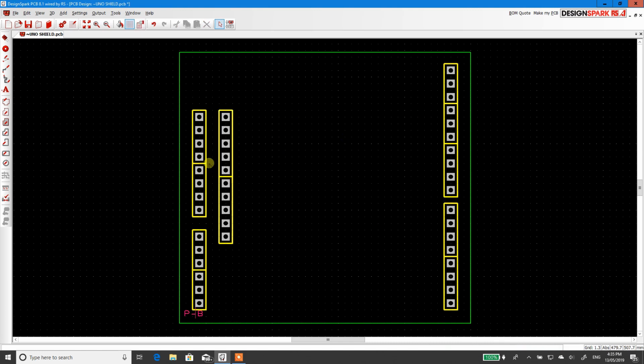Alright, so that's how you can quickly bang them down, and then you can just line up your tracks. So if you wanted this one to line up with that one, this one to line up with that one, to line up over here, and so on and so forth. That's how you can do that quickly. In the description there's going to be a link to how to export Gerber files from this thing. Now a Gerber file is the file that you need to upload to the internet to a PCB manufacturer to get it made. Now I'll show you the results.